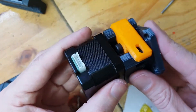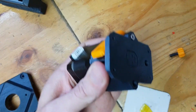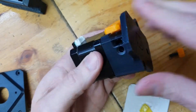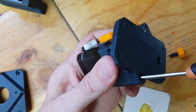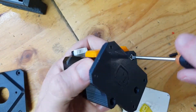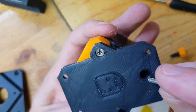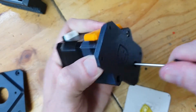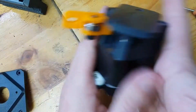You don't have to tighten this down very hard — just put the bolt in, make sure it's snug, and hand tighten it. Then we attach the motor. The first screw I'm putting in is the one that actually acts as the hinge for the inspection door. Once we assemble that, there are just two more bolts — it only makes use of three of the four corners of the motor. You can actually even use only two and it's still plenty strong. So that's how you assemble it, and we have an extruder — it's very simple and it works quite nicely.